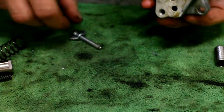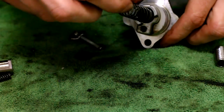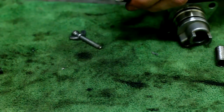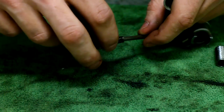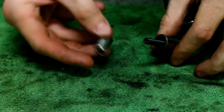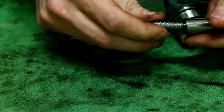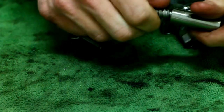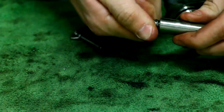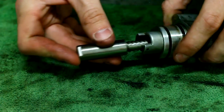Make sure you've got that back plate off and you've taken this plug out of this hole — it's just a flat head screw. From this side, put the large spring in first; direction doesn't matter. Then take the pin, take the little spring — direction does not matter — slide it back over that pin, then put that into the plunger. Then take your worm drive that you worked on earlier. It's got a large end; that large end goes over the spring. It's going to actually screw into the plunger and you'll feel it compressing that spring on the inside. It should feel a little rough because you've got that rougher surface from before. Loosely put together, just screw it in as best you can, leave that big spring in there, and put the assembly together as one.